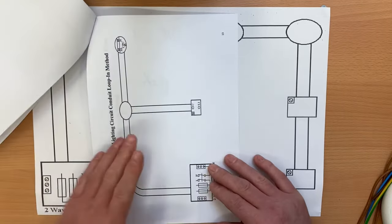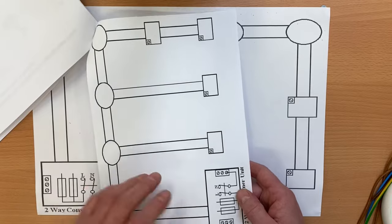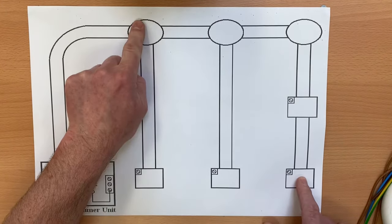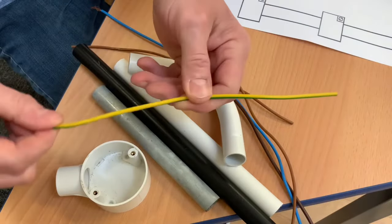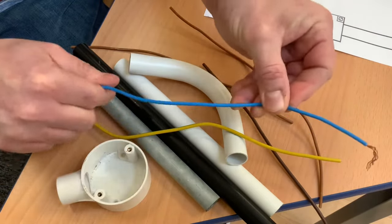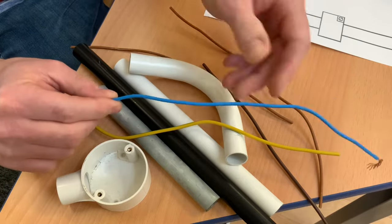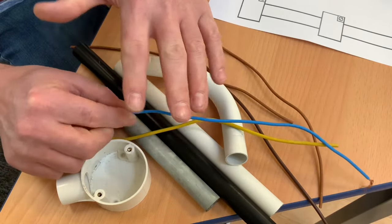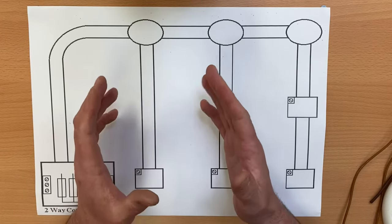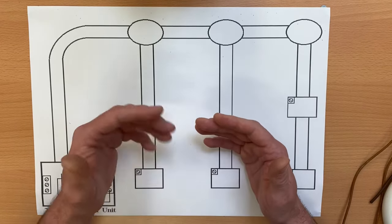At the very back of this book there's marking criteria and some of the other diagrams we've used in this series — you'll need several copies of the diagram sheet if you're working through these with me. We're using single insulated cables, as a minimum 1.5mm² for our lighting circuits — stranded for greater flexibility when pulling them through the conduit system. The conduits provide mechanical protection, so conductors can go exactly where needed, unlike with the three-plate looping method.